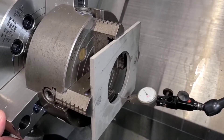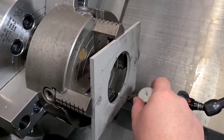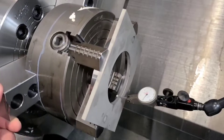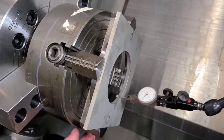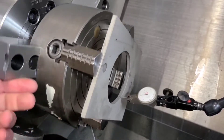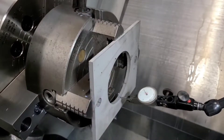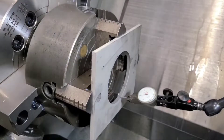Our highest jaw is right here. Let's apply more travel to the indicator and take it to an even number — spin it so it's easier to read. We're on zero at our highest point and our lowest number is roughly 10, which corresponds to the opposing jaw. Sometimes the low point is actually between two jaws, in which case you adjust both the same amount. So: our low point is 10, our high point is zero. We're going to tighten the high jaw and aim to go halfway — to the five. If it won't move, loosen the opposing jaw on the bottom. We've gone to the five.